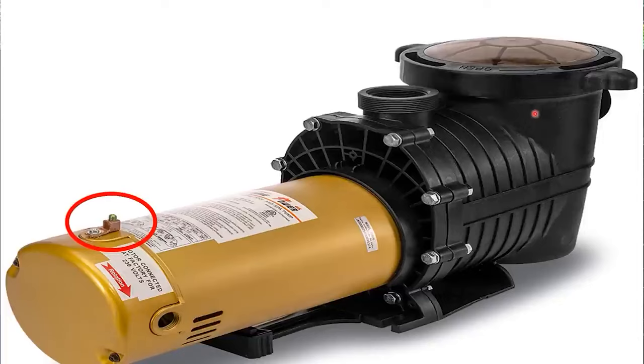If the water bond fitting loses contact during backwash or maintenance, people in the water could be left outside the equipotential plane while in the most dangerous situation of being fully submerged. Another option is a skimmer-mounted water bonding fitting — it lays inside the skimmer, with a rubber washer poking out of the skimmer basket and a lug on the exterior of the skimmer wall where you connect your number-eight conductor. Whether you use a skimmer fitting, a ladder, or a dedicated water bond fitting, it must be in constant contact with the water and must provide a minimum of nine square inches of contact.